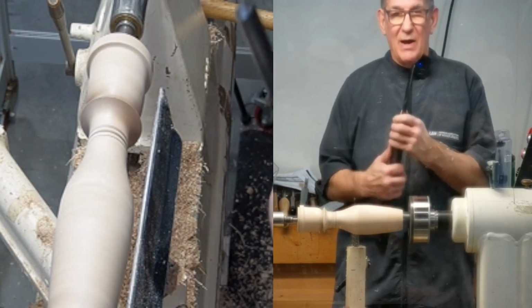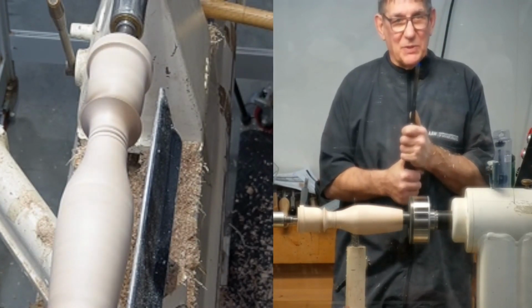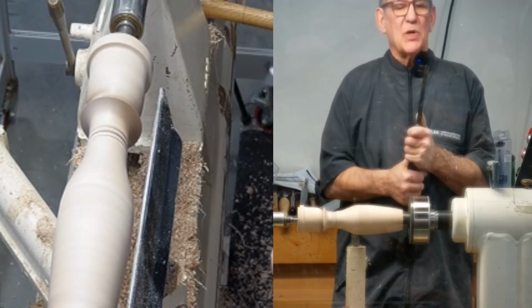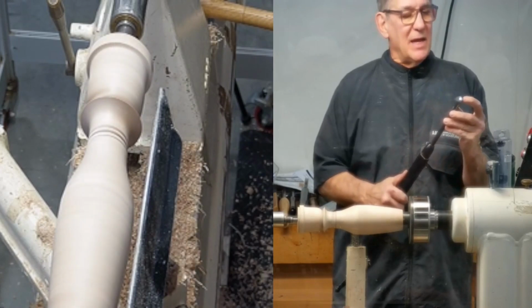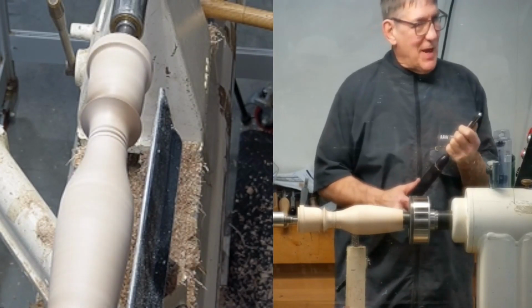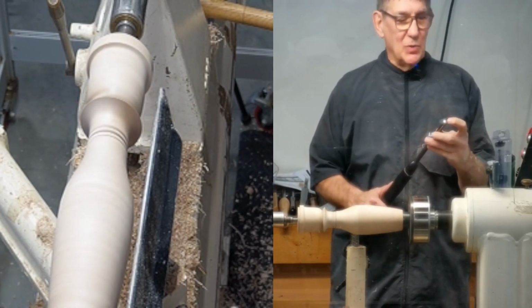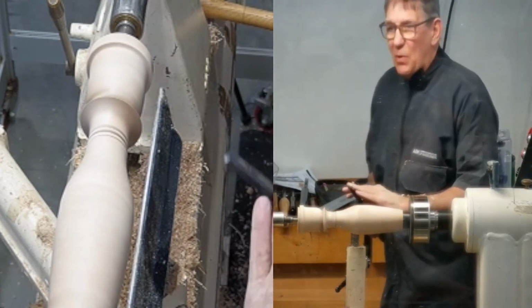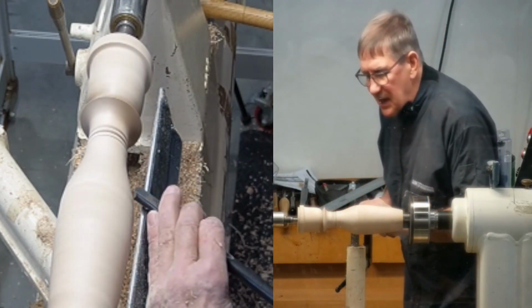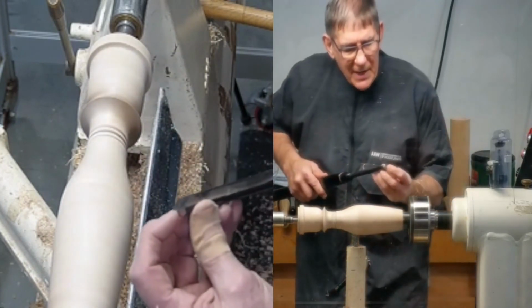I use a V where you're not supposed to. What happens is, because it's a V, if it's hard maple, it shreds it. I lose that tip right where I'm cutting. So where this hits on this type of cut, I create a witness mark right here.